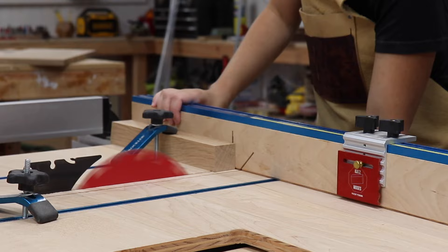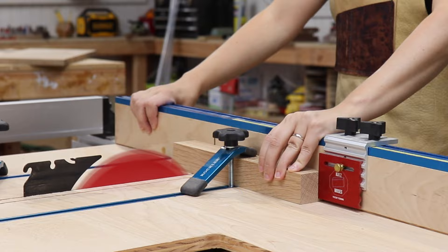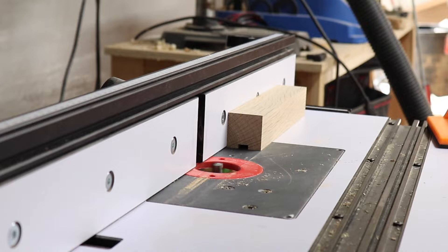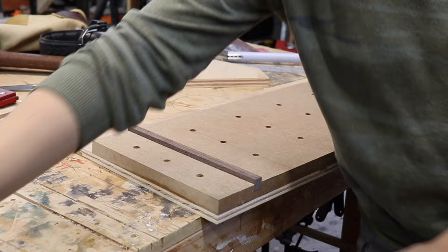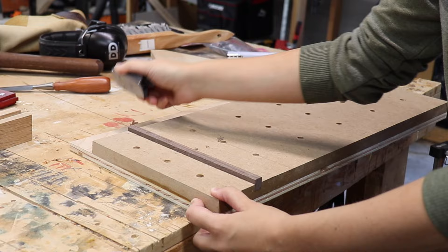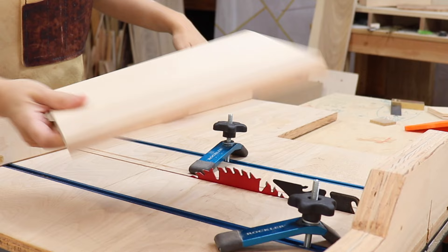The first attachment is a regular fence for cutting square end grain and edge grain. I found a scrap, cleaned up and squared one end, then used my stop block — still set from before — to cut it to size and brought it to the router table. I still had the half-inch bit set up and raised it so it would fit into the main fence on the jig. Jonathan Katz-Moses suggested putting a little chamfer on top of that piece to make it easier for the fence to go on — great idea. The piece went on easily but still had a friction fit.